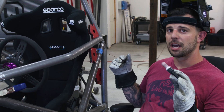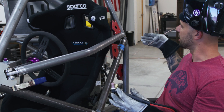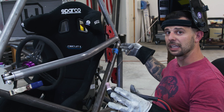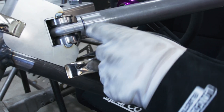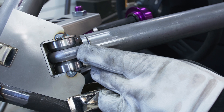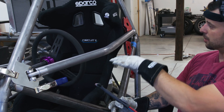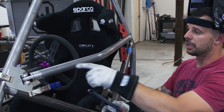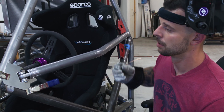We had a lot of parts come together all at the same time here, so I had to do a lot more massaging than I was originally intending. The overall length of this bar is kind of critical, so I had to do some trimming back here to make sure it allows itself to come into the cage. I actually think I need to do a little bit more trimming, but right now it's wedged in there and holding itself where I want it. So I'm going to leave it exactly like that and do that trimming once the hinge is on. The hinge actually inserts itself into this tube right here. I'm not going to do a plug weld — I'm just going to weld around this outside seam since we're not going to have any strength that requires a plug weld. I'm really happy with the angle. I'm going to throw some tacks in this corner and a couple of tacks on my tube, and then we're going to see how this hinge opens up and what it cosmetically looks like when it's open.